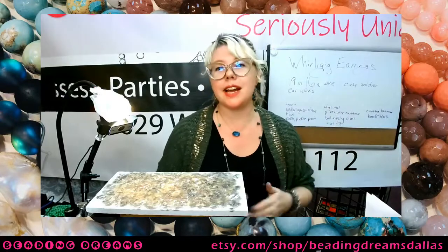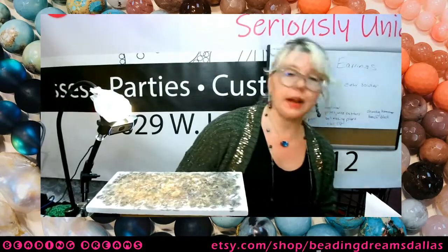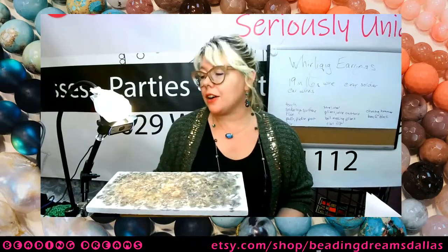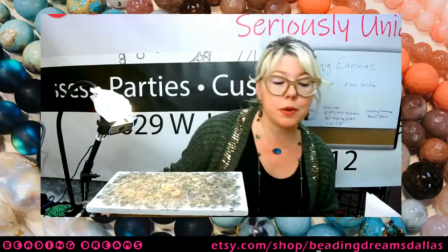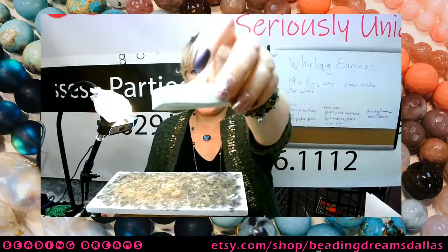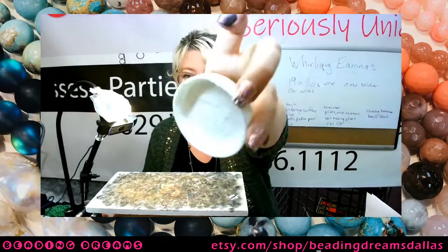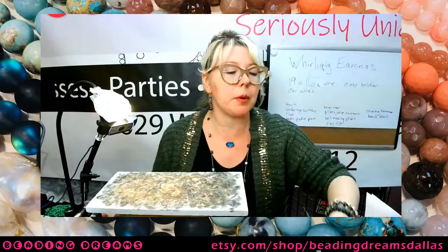Number one, try your best to keep 6 to 8 inches of clear space around your soldering area at all times. That means 6 to 8 inches that are completely free of anything that is flammable or meltable. Also, this flux jar lid has a message for you. It says, hey, guess what? Lots of things that are meltable, once they melt, are also flammable.